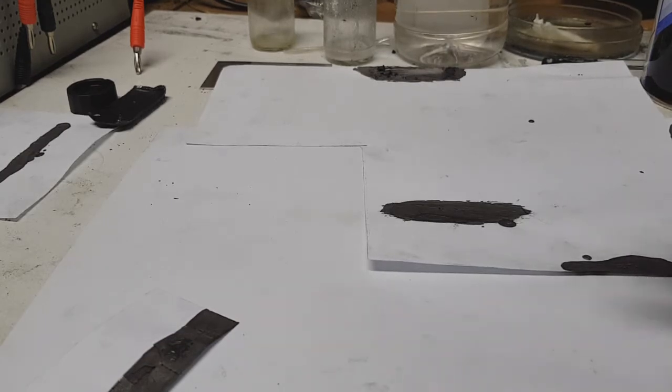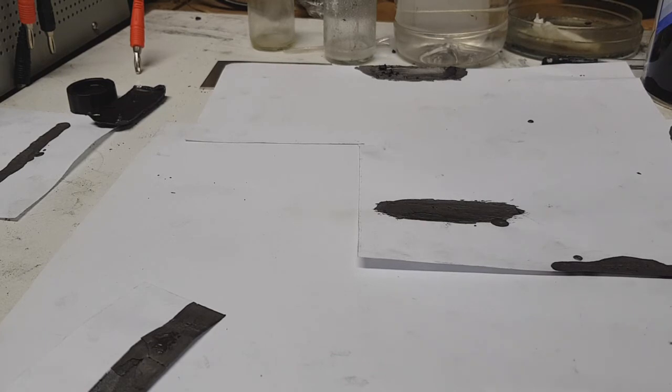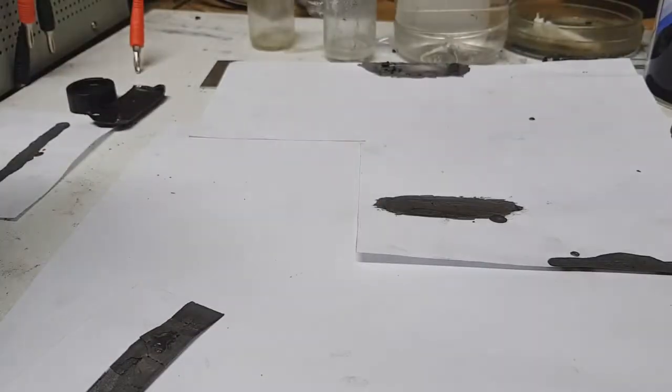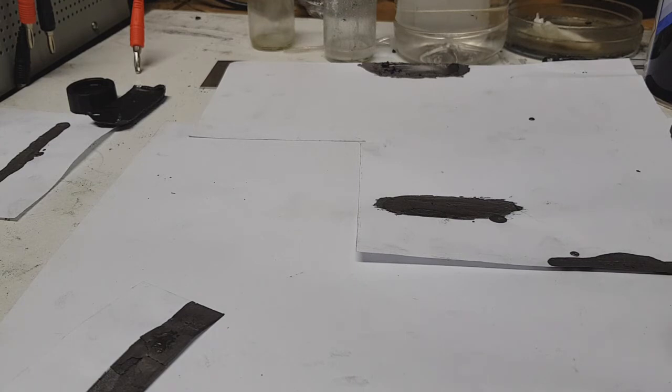And now, how to make this ink. To make this ink you need three materials. You need some sort of conductive material, which is graphite or graphene — every conductive material will work. But to make this ink really cheap, graphite is really awesome. So you need some conductive material, and also you need some sort of solvent.